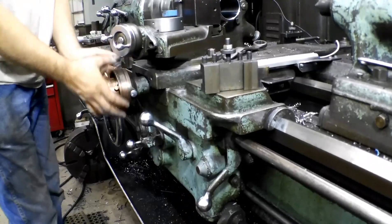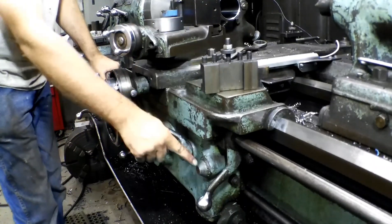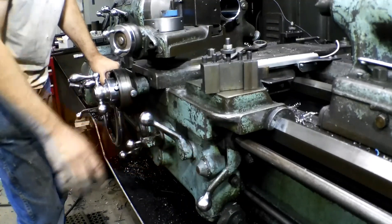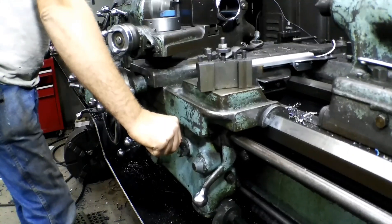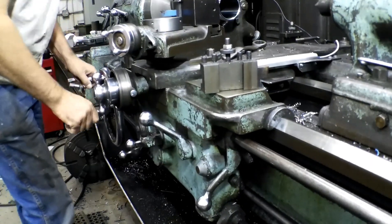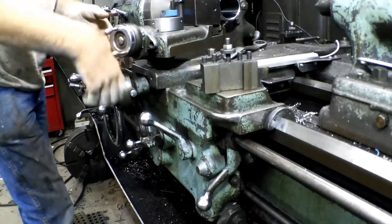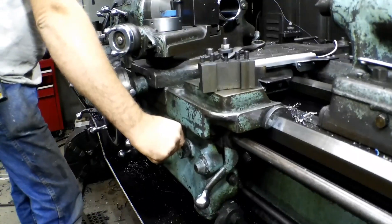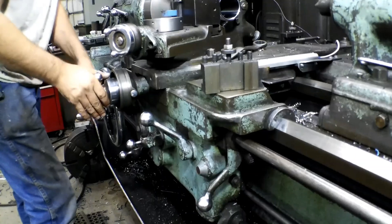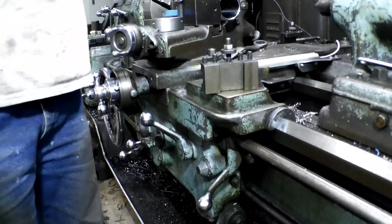Let me move the camera so you can see the thread dial on this side. I've got my cross slide zeroed. We're going to go in another 20 thousandths. Here's the thread dial — the number is on here and you can go between the numbers perfectly, but if you go a quarter of the way that starts another thread. So catch your number, run it in, get to the end of your thread, back out your compound, bring it back to start, back to zero, and then take your next pass.